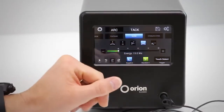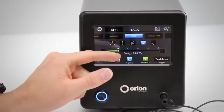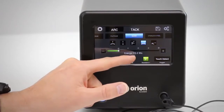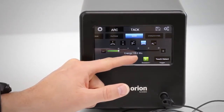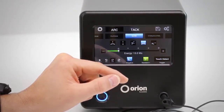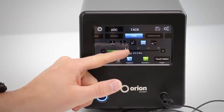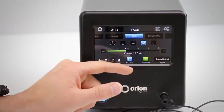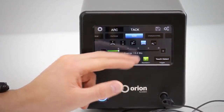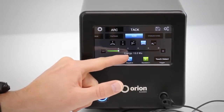By selecting silver and adding metal, the energy of the weld has been set automatically. Right here we suggest 15 watt-seconds of energy based on the metal type and joint type that you selected. From here you can change that energy up or down if you feel like you're going to need more or less. But if you want to use what we have recommended, just touch the joint type again and it'll take you back to the suggestion that we have.